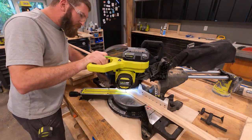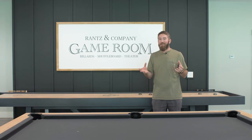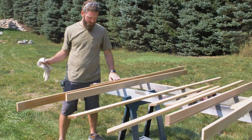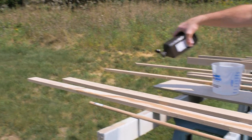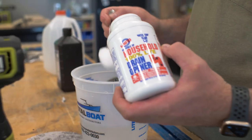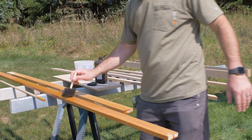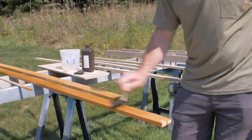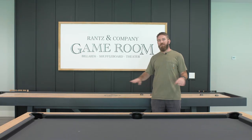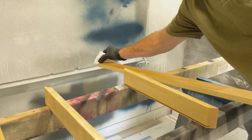With all the wood cut down, I moved on to bleaching the red oak. Red oak is very red, especially when you apply a finish that really brings it out. So we bleached it using a peroxide wash on the 1x2s, then came back and applied a lye water mixture and laid it out in the sun — that takes a lot of that red out of the wood. After bleaching, we washed it down with clean fresh water to remove any remaining lye and applied a wipe-on polyurethane.